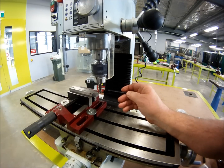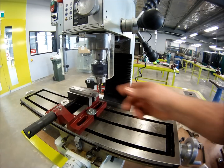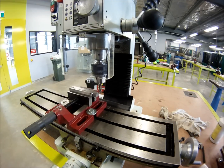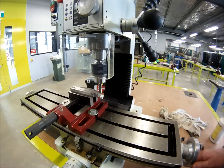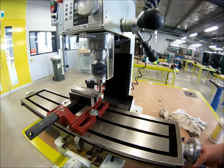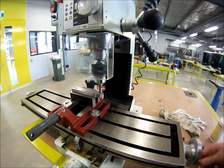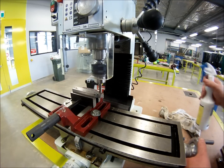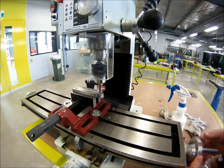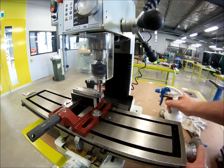I'll be using this drill chuck for this demonstration only — I do not advocate using a drill chuck to hold an end mill, so please remember that. I've set the depth and length that I want. Starting up at about 500 RPM on the spindle, I'm going to feed it in slowly — just to show that this little mill is capable of cutting into bright mild steel. This is a high-speed steel 12mm end mill — conventional milling.